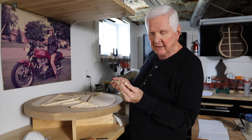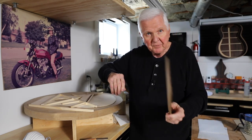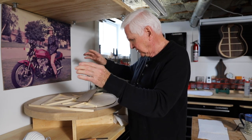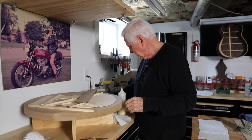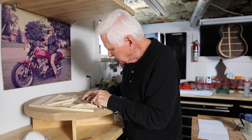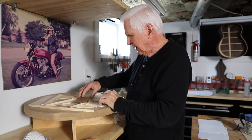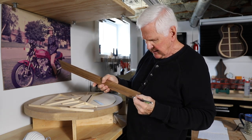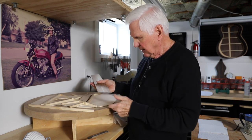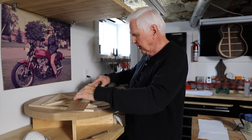I've cut the angles here, and what I did to get these angles perfect on the bridge patch — I simply set the bridge patch piece across there, took a ruler, lined it up, and drew a line. Once I had my line, I then cut that on the bandsaw on the wide side, and then I bumped it up against the sander, pushing it in until it fit absolutely perfect — but it was too wide.